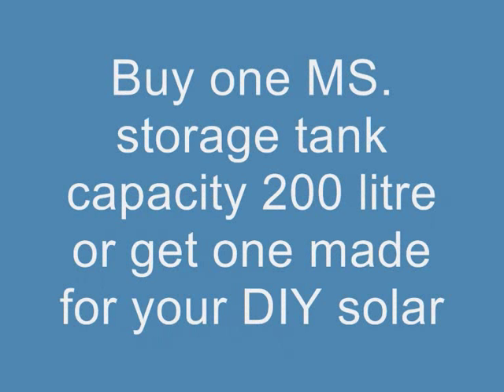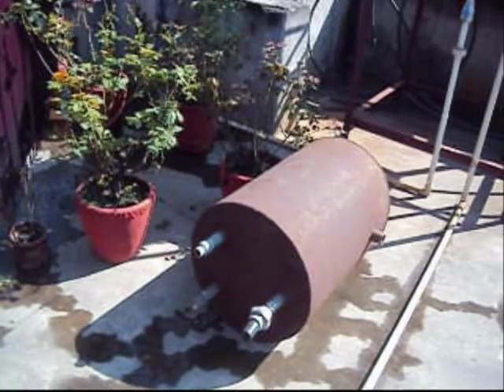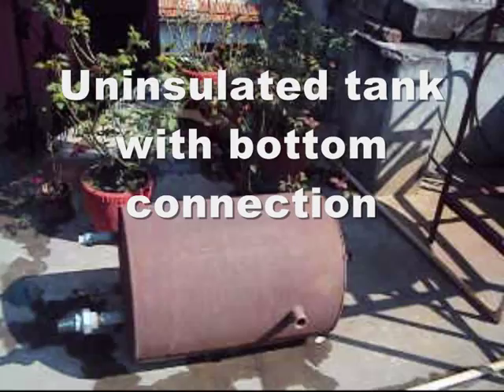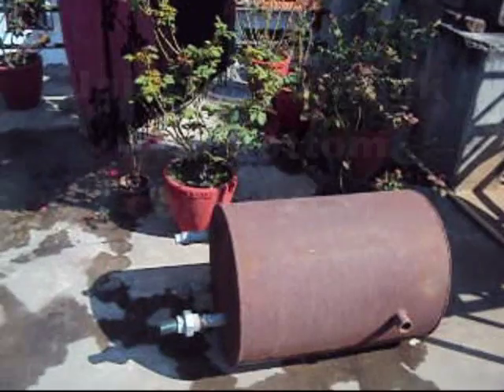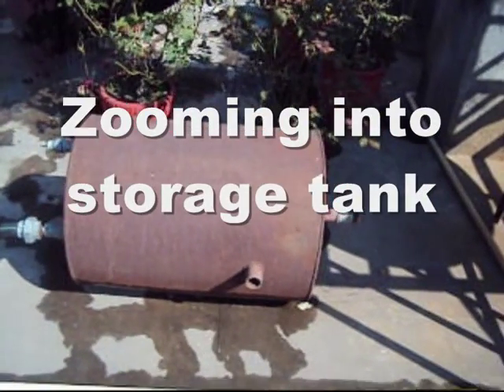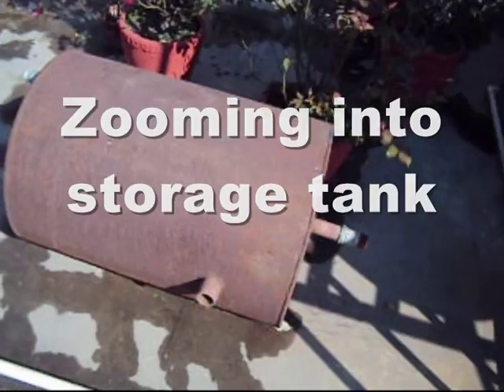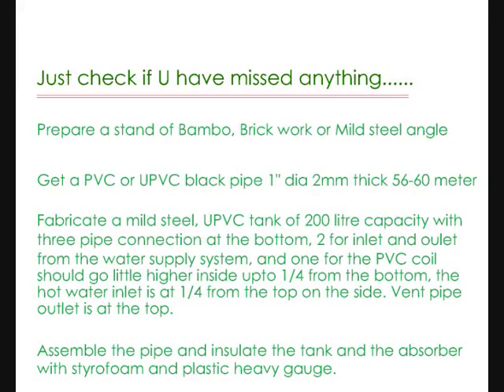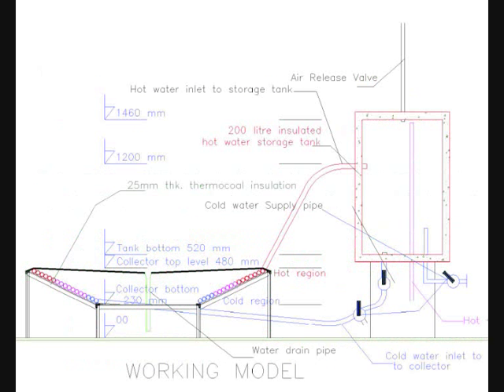Third step: get one storage tank of mild steel — you can get them from a shop or have them fabricated. It should have three connections at the bottom and one at the side, which should be one-fourth from the top. There is one outlet at the top for venting. The PVC coil is connected as in a normal solar heater, but note that the supply line and discharge lines are the other two connections. If you have forgotten anything, you can follow the chart and the drawing, but don't forget to insulate the storage tank and the solar heat absorber.